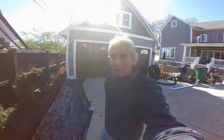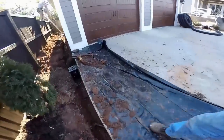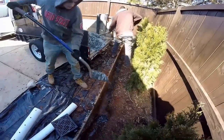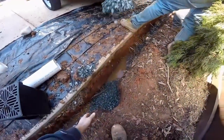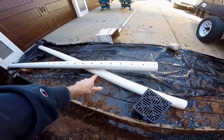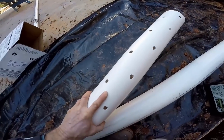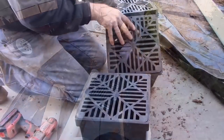While I was going to get gravel, these guys have already put down the catch basins in here. They've got the trench dug out — you can see water collecting in there already. Now we're getting ready to fill up this trench with gravel. We're down about 20 inches and we've got a whole yard of gravel over there. We're going to put an entire base down here along the bottom — a good six inches of gravel at the bottom. Then we'll set our catch basins. We're going to use four-inch PVC with holes in it, and those holes are going to point down into the trench. Then we'll finish covering the top.